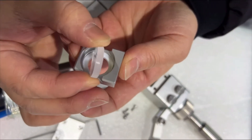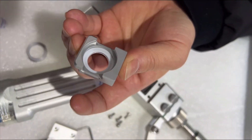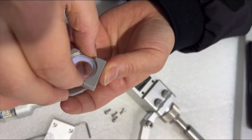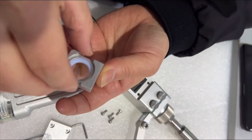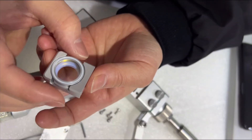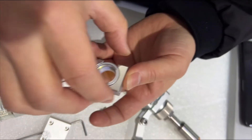This is the welding focus lens — its focus distance is F-150. This is the cleaning focus lens — the focus distance is 400 millimeters. Make sure the spherical surface faces the nozzle when installing. Now install it back and make sure the sealing ring is stable.